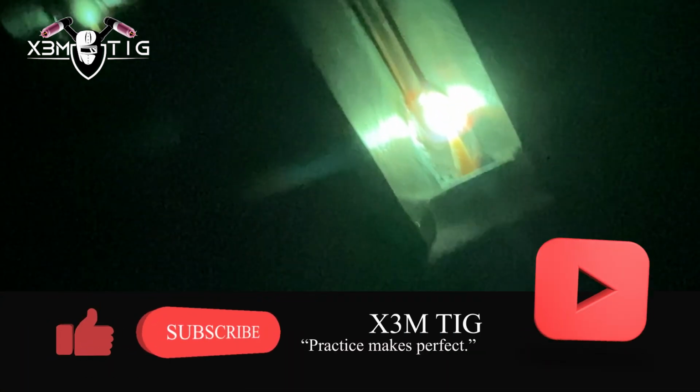Dipping technique, as you notice, that's what I like to do in my previous videos. If you watched, you see that's something I like to practice. It works in multiple cases. If you got a closed gap, or if you just start getting gap closing on you, dipping technique is something you want to do. You want to open it side to side, adding wire. You know you're gonna burn those edges. You're gonna put that in.